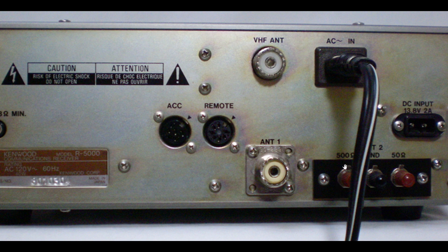We try to match as much as possible, and that's why these connectors exist. If you have a long wire antenna, you might connect it here to the high-Z input, because 500 ohms is closer to what we call a high-impedance antenna — which is typically what all wire antennas are. So that's why these types of connectors exist on the radio.